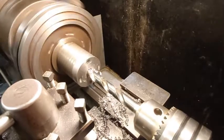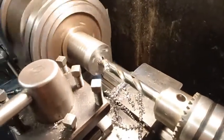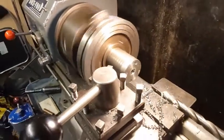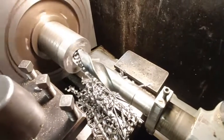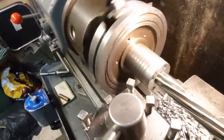I'm now drilling the clearance hole in the boss of the rotary table. It will then be opened out to the full size to match the bore which already exists. There is no taper in this table — it's a parallel ream, straight through.